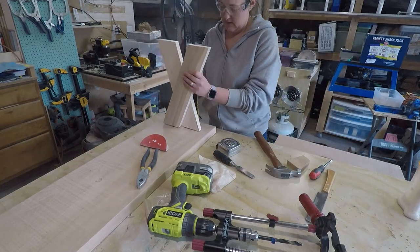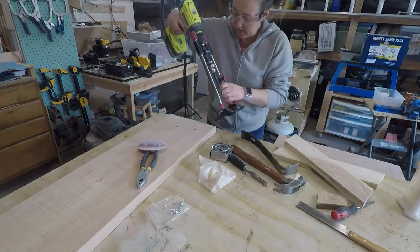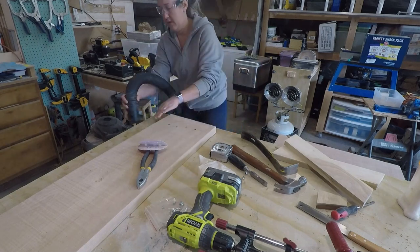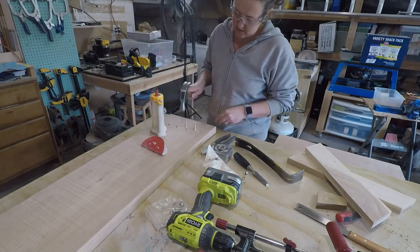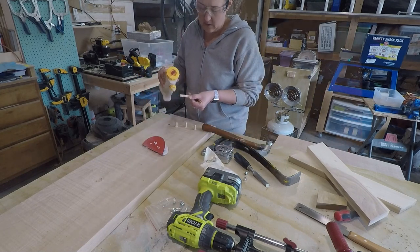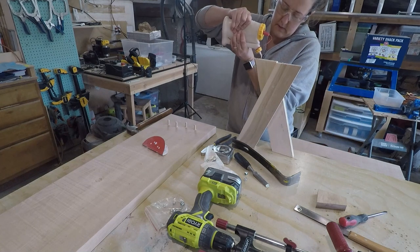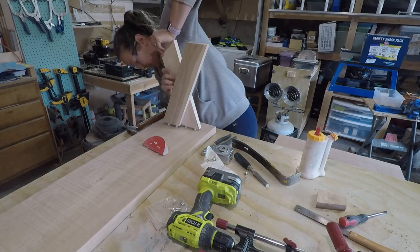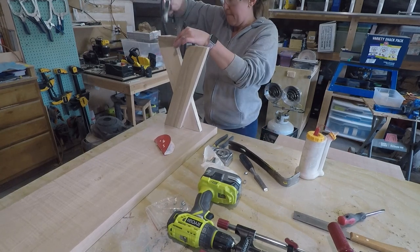After the first two holes were done, I attached the center points to the other holes — I only had two center points in the size of dowels I was working with — and then I repeated the process until I had all four holes drilled. Always do a dry fit first before trying to attach everything with glue. Then I was ready to glue it together. If you don't have a doweling jig and don't want to add it to your shop, another option would be to use a figure-eight fastener — those are attached to the top of the legs and then to the underside of the bench. I love how streamlined the dowel worked with these X legs.